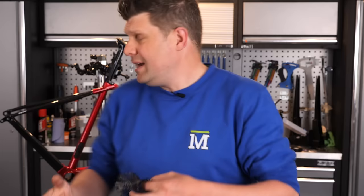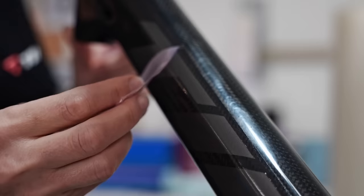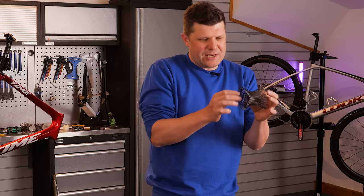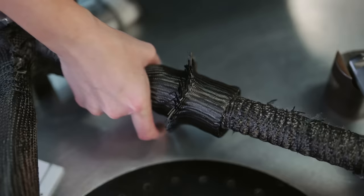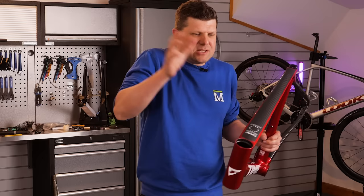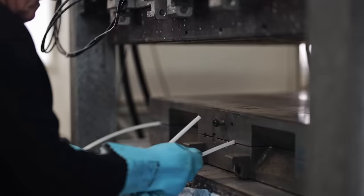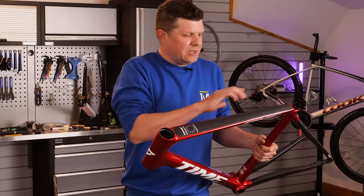Then they put over a layer of that 4K, which is actually like a final sheet - really just there for cosmetics, to show that yes, it really is carbon. Because underneath it would probably look a bit messy once you've pulled the sock out. But the mould splits and you can pull it around all these joints to make sure everything is covered. Once the carbon socks are pulled over the wax and the 4K pulled over the top, this goes back into a mould and resin is injected through one side with all the air expelled out the other. So we almost completely eliminate the possibility of voids because there's no layering up - the carbon isn't pre-impregnated and we're actually forcing the air out as we go. You should get something significantly stronger for the same amount of weight.